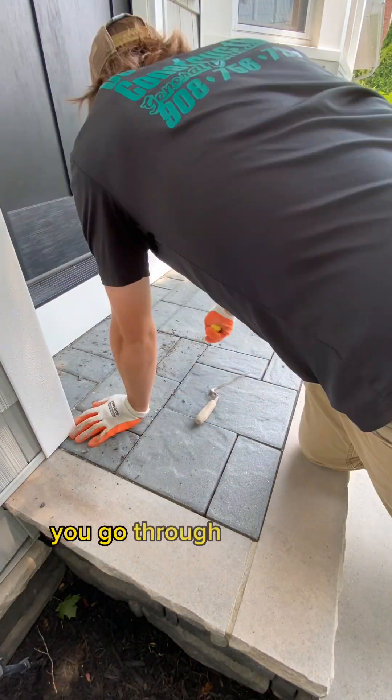Once this is all the way done, I turn my attention to the walkway that I am redoing and hose it in the same fashion. Here you'll see the finished look — it's still a little wet. Now it's time to hose the walkway on the shower setting. They say to do it for 30 seconds, but you don't have to count it out. You'll know when you know. Then you hose it down, and here you'll see it got into all the joints, and all the white suds are entirely off the patio.